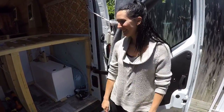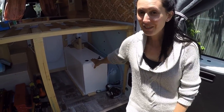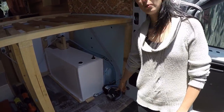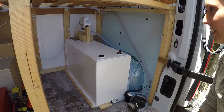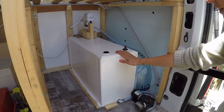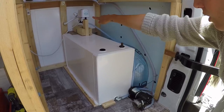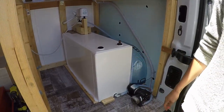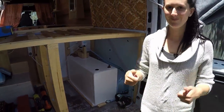Hot water and plumbing is done! Very excited — Frank's done a magnificent job. We have our 114-litre water tank, which will hopefully be big enough. That is connected to our flow power pump running on DC. Frank has done some lovely conduit here so that all runs to our load centre. Then we have the hot water service, which caused us lots and lots of heartache, but is now working properly — that one runs on AC, so it goes through the inverter with normal AC power. It runs through that little hole into our bath, it's all secured, all works, awesome water pressure. We can pretty much have normal showers, which is ace, and we still have some storage space — very, very happy.